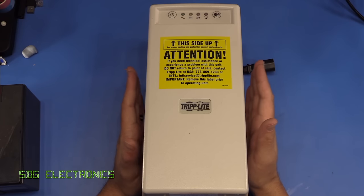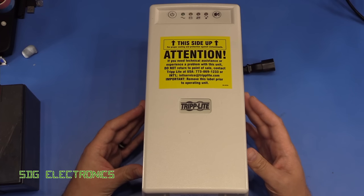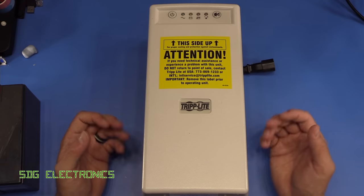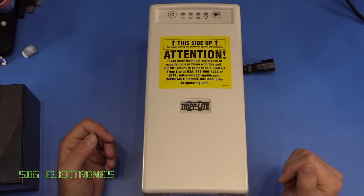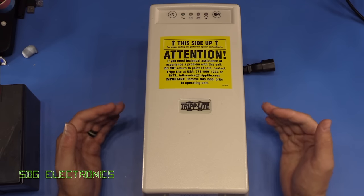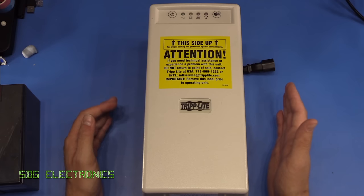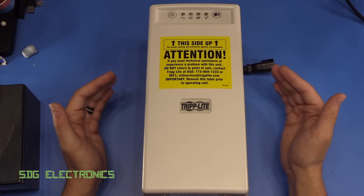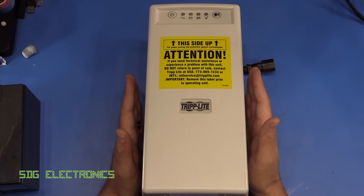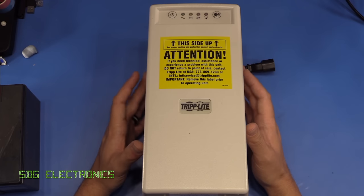I don't actually think we'll go with something like this because it's a little bit unwieldy. But this is specifically a hospital grade UPS unit, which means it meets the IEC 60601 medical regulations. Partially, that imposes restrictions on the overall EMC limits. We have considerably tighter EMC limits — both in terms of radiation, where it needs much lower limits than standard consumer equipment, and in terms of immunity, where there are higher levels it needs to cope with.